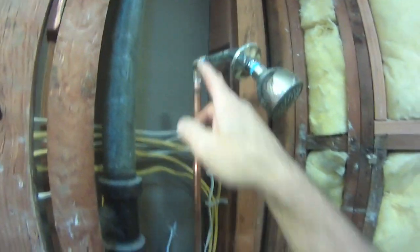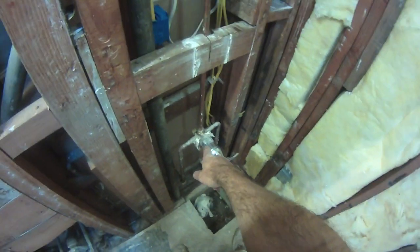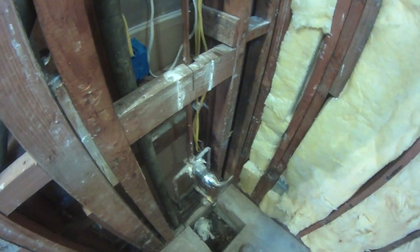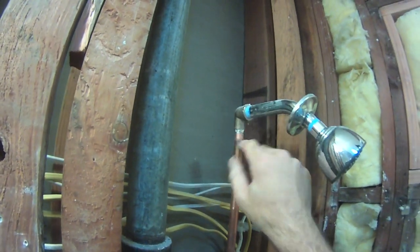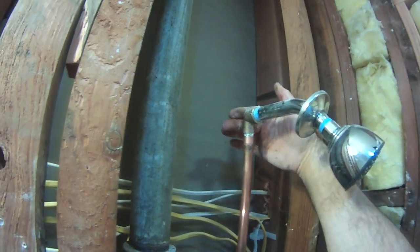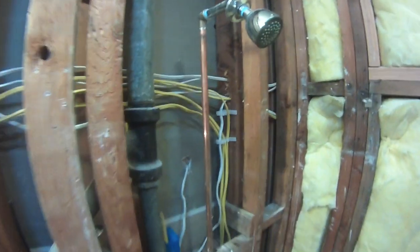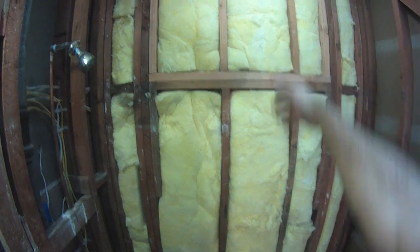And this is funny, when they did the retrofit, I'll call it, because this is not the original. This was originally a diverter in the center and the two taps are on either side. They never secured it. And when they did this 90 threaded sweat fit, it doesn't even have the ears on it to secure it to anything. So I don't know how far open they got this wall. This used to be an exterior wall to the house, the master bedroom. The addition is now on the other side.